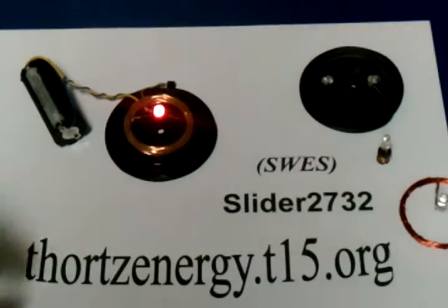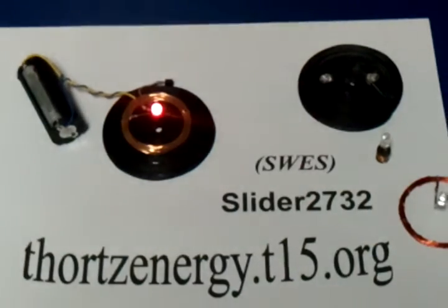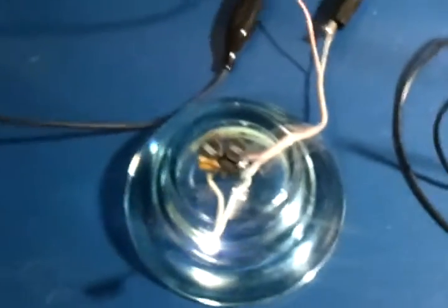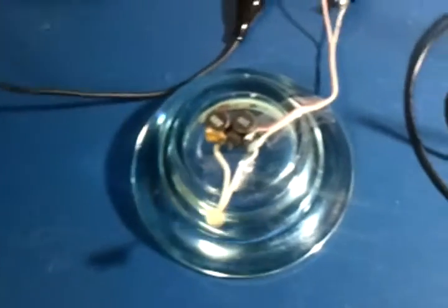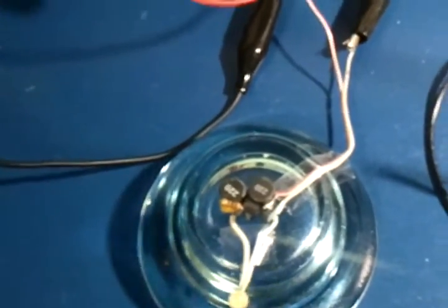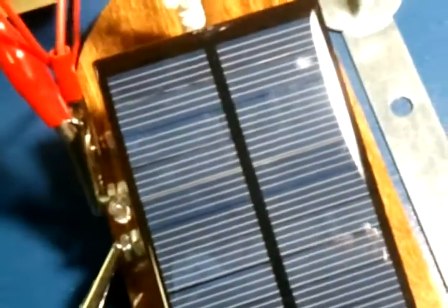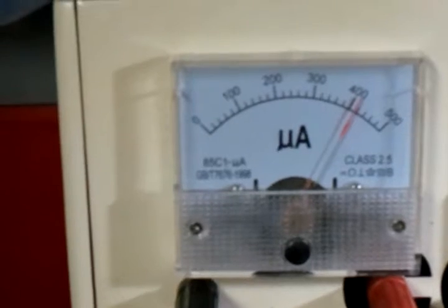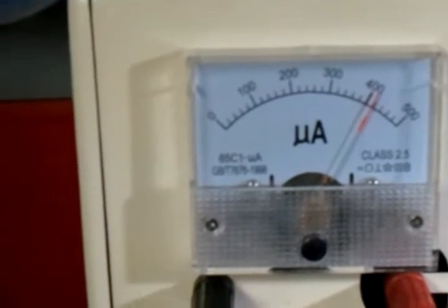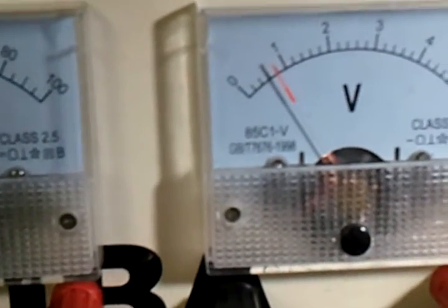Let me show you something I found really quite interesting. I got to playing with this stuff and pulled out a blocking oscillator, wondering if it would work with the blocking oscillator. This is just running off of a solar panel — I've got a fluorescent light indirectly shining on it. The circuit right now is using about 420 microamps and pulling about 0.8 volts.